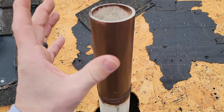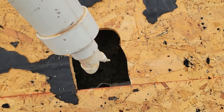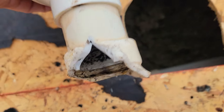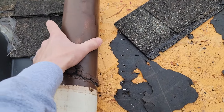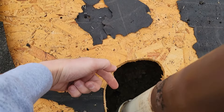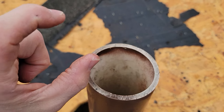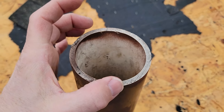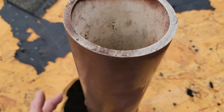From experience, one of the most common things especially with PVC is a broken pipe. Look right here — we have a broken pipe. Any rain coming into this is not a lot compared to rain running off your roof from something done wrong, it's just what rain hits this hole directly. So if you get one inch of rain, you probably have three or four inches worth of surface area coming into this — it's not a lot, but it is enough to cause a problem down below.